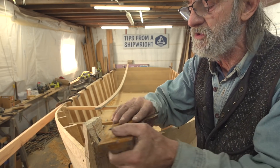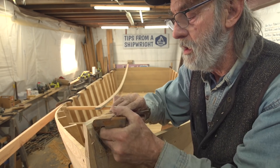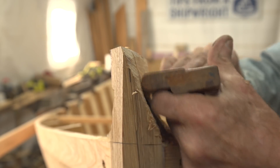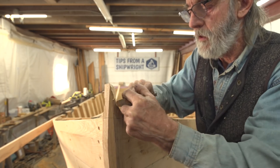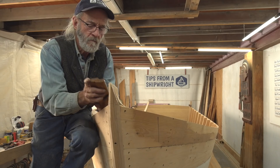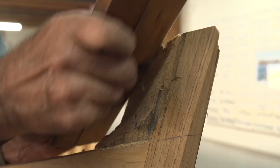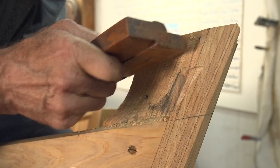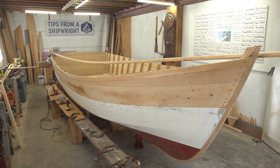This is going to go a lot easier because I'm not on the end grain here, so it planes pretty decent. I have in mind to thin it up on the forward side because I didn't have a line on the forward side when I took all that material off with the chainsaw. With the hand plane I kind of have to work the two sides the same — eventually they have to match. Then I'm going to scoop out the bow end of it, put some sort of a little radius as it leaves the guards up to the top, and maybe round the tail off a little bit. I'm also going to cut it down an inch or an inch and a half at the top. I'll probably take it down a little bit more, then sand it and different things to get it to look really nice and pretty.